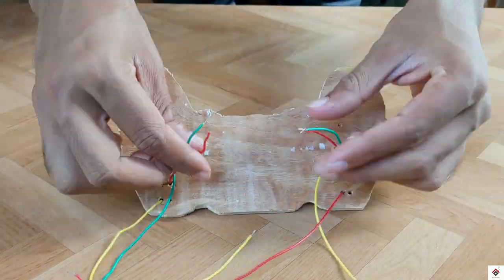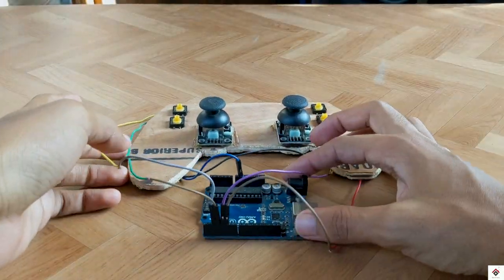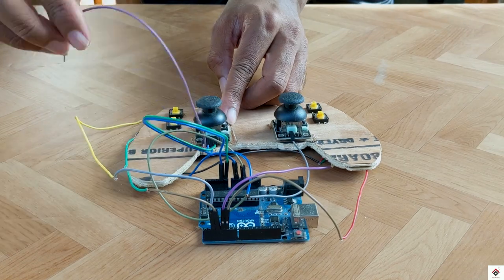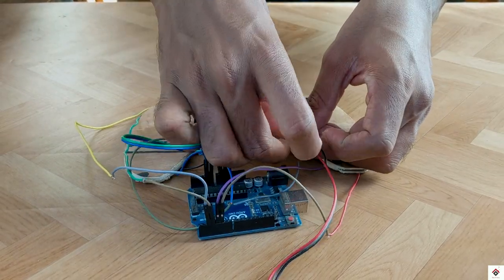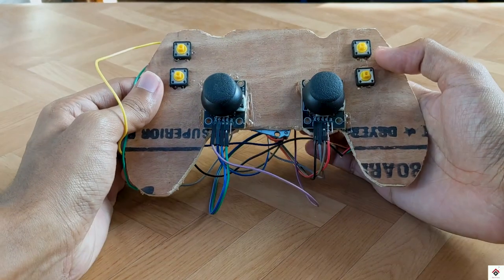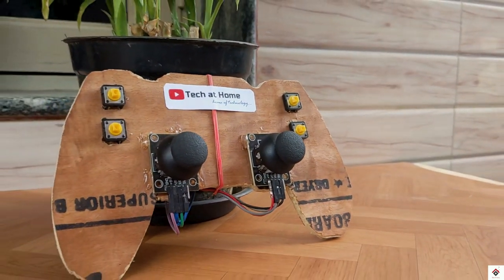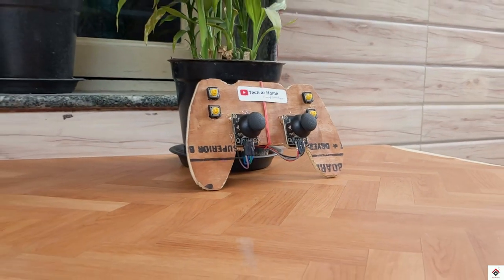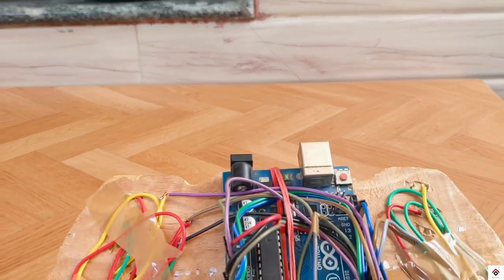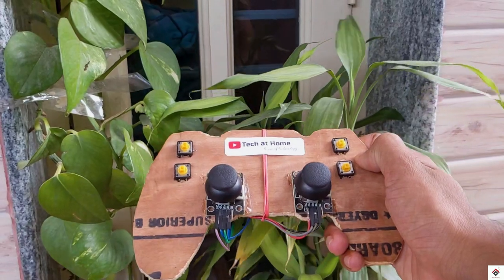Coming to the connections, I have provided the circuit diagram link in the description box. You can refer from that. It's very simple. The analog axis of the joystick modules will be connected to Arduino analog pins starting from A0 to A3. And for the digital push buttons, we can use the digital pins starting from pin 2, 3 and so on. We are done with all the connections and the hardware work.